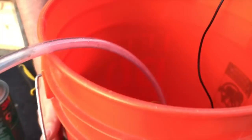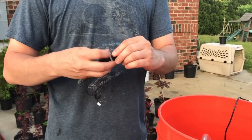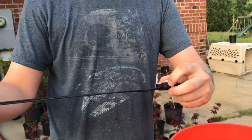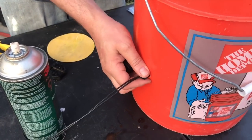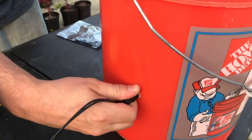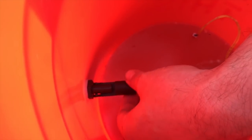Now we'll attach the water level sensor switch in the pre-drilled hole. We unscrew the clasp and slide it in, putting the rubber O-ring on the inside. We feed it through — we drilled the hole a little bit smaller than the outer ring, using a 3/8 inch bit and wiggling it around. You could get away with a half inch bit or a little bit larger. Orient the level switch so it falls down when there's no water — when there's water, it'll float up. We'll show you how to configure the trigger in a separate video, with links in the description.